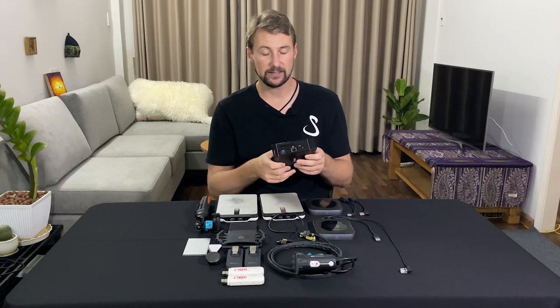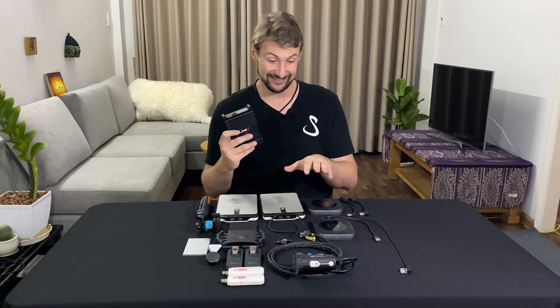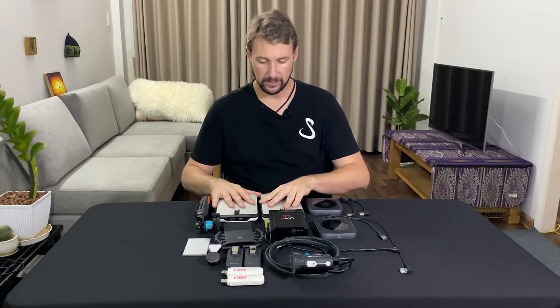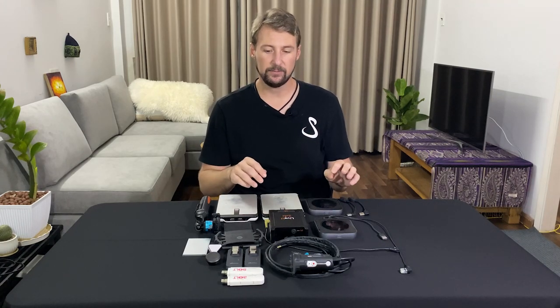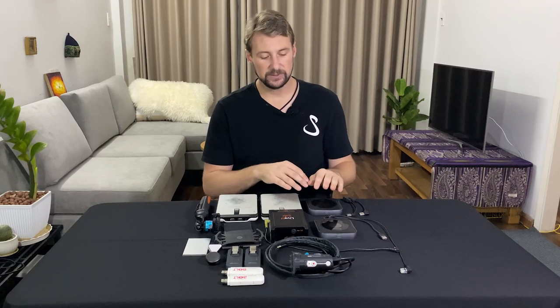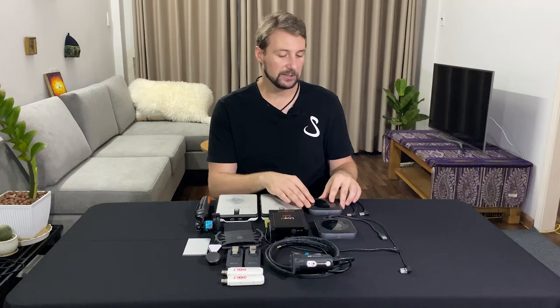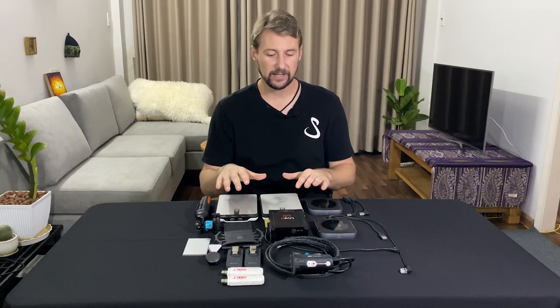You can connect multiple different devices as far as the 4G SIM cards go. With this particular model, you cannot just slide SIM cards in — you'll need a 4G modem or 4G router. I have six modems on the table but can only use four at a time with the LiveU Solo. Depending on where I travel, there are different bands that routers use, so an American-built router taken to France can run into trouble depending on the provider.